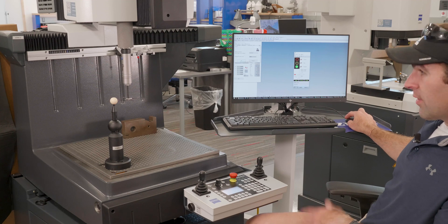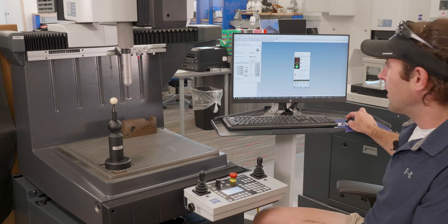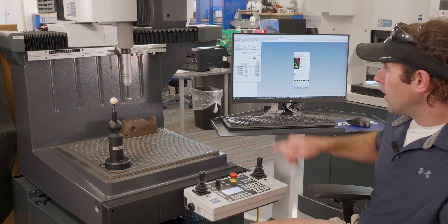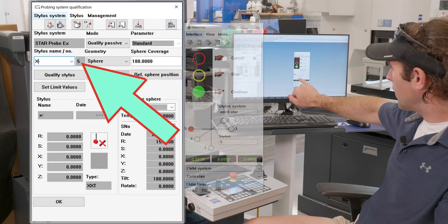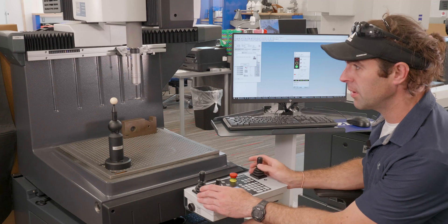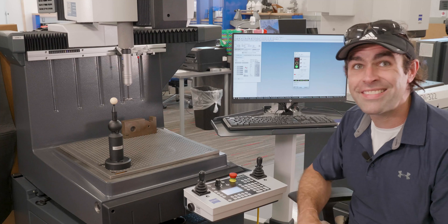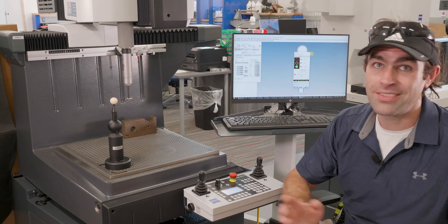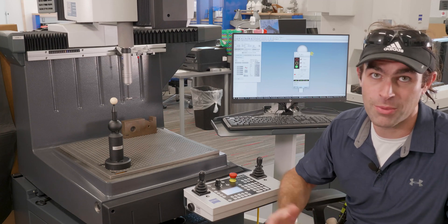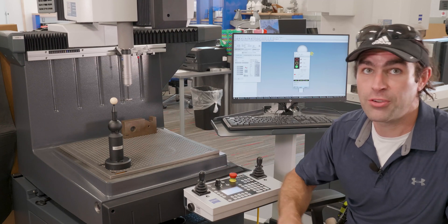Hit qualify stylus and it asks the probing behavior questions. This stylus is not special in any way — it's not long or short or heavy or light — so we're just going to hit OK to the defaults. Probe in the direction of the stylus shaft. You might want to double check your numbers; I've got five here and I'll look at my stoplight to confirm it's going in the right direction. I'm going to drive it right into that reference ball — it takes a beep, and now it's going to do its thing. It takes a couple of minutes. You've got to do this for all four styli, so it might take 20 to 30 minutes. I'll speed it up in this video.